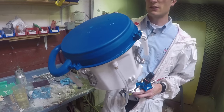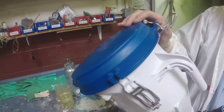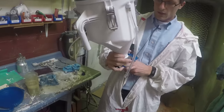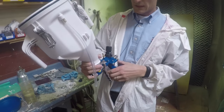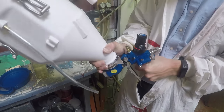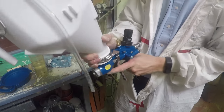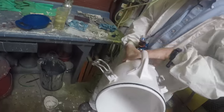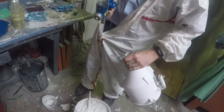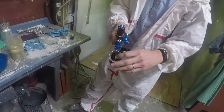It simply just latches into the edge there and pulls down, as you can see — very easy to do on each side. Changing and cleaning is very easy; it uses this little coupling system to hold it down. You can just pull up here and it'll come right off. You'd want to empty this out of any material, then pull off the hopper itself, and then just run water through here to clean it.